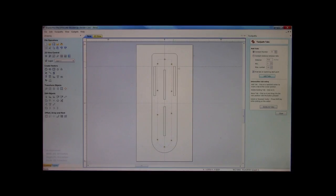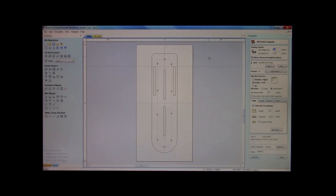Alright. That should do a pretty good job of holding things. Always double check everything. Your starting depths, your cut depths, because it is really a shame, and I've done this a few times. I've gotten halfway through a job, I've loused it up, and I've had to scrap the job because I couldn't salvage it. Because of what I did here. And because I didn't catch it up in my shop on the equipment. Okay?